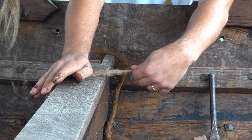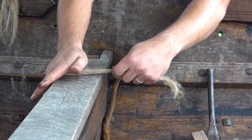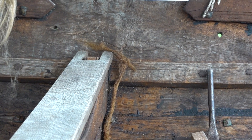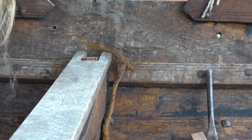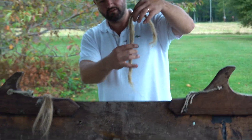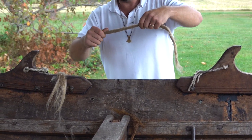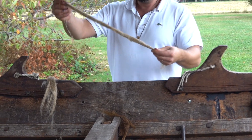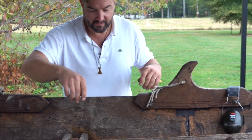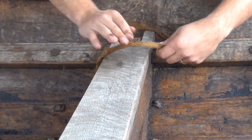It's just as good, especially if you're going to pay — paint the seam after. It's much better on like a piece of fabric. Then I go through and spit on my hand and continue to roll it. The spit kind of activates the oakum, and then you'll get a nice strand. You can still tease out a little more. This is another aspect of caulking that takes a while to really get the hang of. Generally you want it to look something like this if you're caulking a ship.